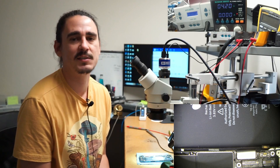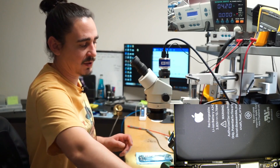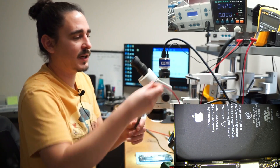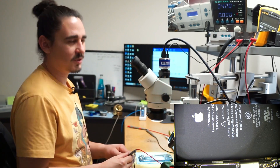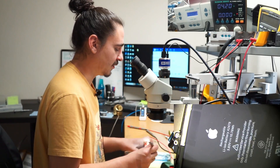Something is just preventing this CPU from turning on, so my job is to figure out what that is. My first step when working with this is to usually assume that I have a shorted power rail. It could also be a loose boost coil, but checking power rails is always a good first step.